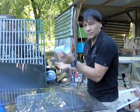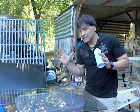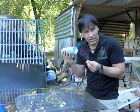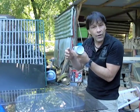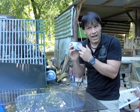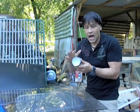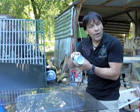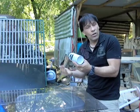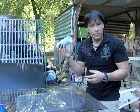This is a spray can. It's different than an aluminum can because it's a little thicker, but the diameter is the same. What makes a forced air heater very, very efficient is the amount of surface area that the air molecules actually come in contact with. With a can, the diameter is very large. So when you have a series of 72 or 36 aluminum cans, the air is going through a very large diameter. Air wants to find the path of least resistance. Because the heat is mostly on the top or around the outside of the can, you're going to get a thermal barrier of air that stays there. The cool air coming out of your house into the heater is going to sink to the bottom and roll across the bottom, heating air on air. So it will work, but you don't need the cans at all.